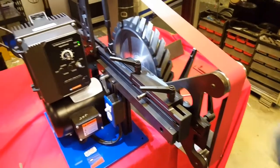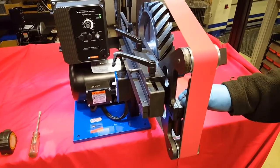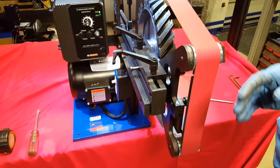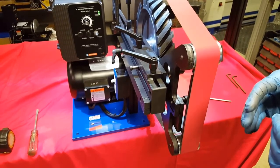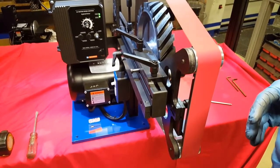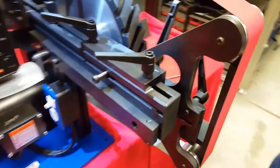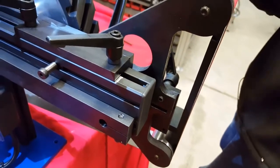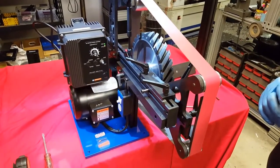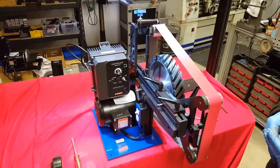That's your key. Now, pertaining to the platen, do not adjust the platen, but eventually you're going to want to adjust it. What you want to remember is the platen does not need to be putting tension on the belt. It just needs to be up very close to it, let's say within a paper thickness, or barely touching it. If you put a lot of tension on the belt, two things are going to happen. It's going to wear your platen down, and number two, it's going to try to track on the front of the platen, which makes the whole system track totally off. So you don't want it actually touching the platen where it has to be readjusted for tracking, because you're going to wear your platen out, and that's not the proper method for running a belt grinder.